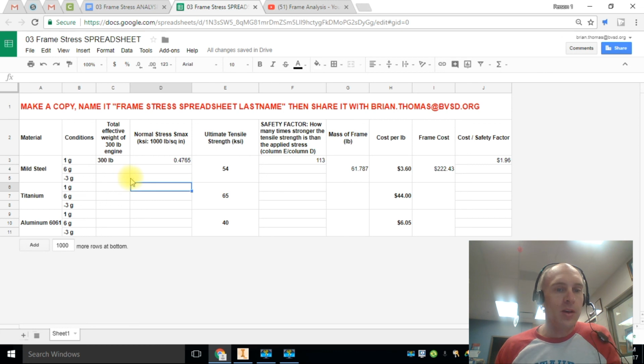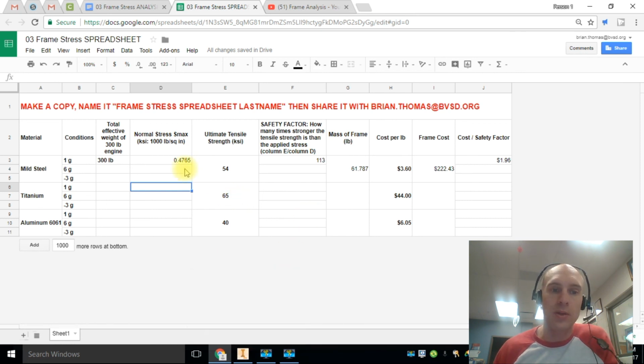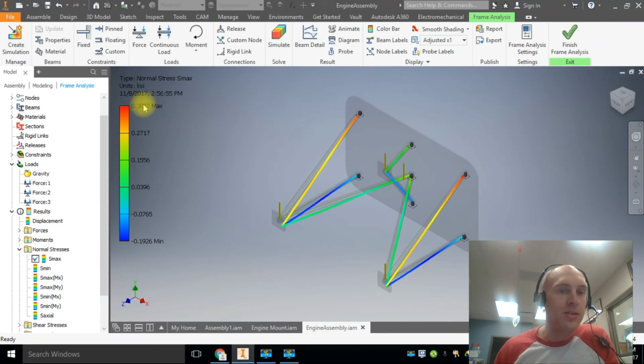I'd record that value. You're going to need to finish up all of the total effective weights, all the stresses, safety factors, and so on. Once you have all this information, you can do the analysis of the data through the conclusion questions. If you have any questions along the way about getting some of these values or making adjustments, please ask me. But make sure that when you are recording these normal stresses, those values make sense. They should be somewhere in the tenths of a unit of a KSI. If not, you were probably in displacement, which means you'll have to redo that one. All right, let's get to it.